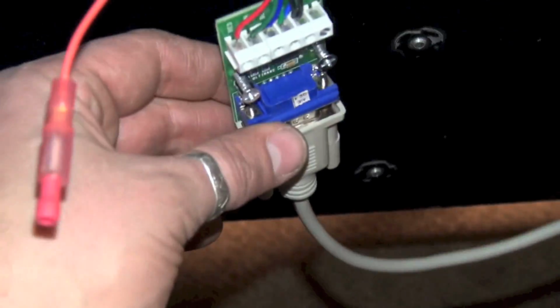Let me just make sure. These wires are loose, but that's okay. We're going to measure the voltage there to make sure that's 5 volts. We're going to measure here to make sure there's no voltage here, because if there is, then we know we need to make a connection. I don't see any danger in that hanging the way it is. Let's just double check, make sure I didn't leave anything disconnected before I turn the game on. In fact, I'm going to turn the switch off on the game. I want to be here when it turns on.